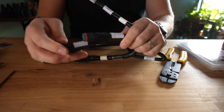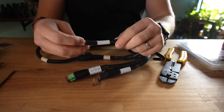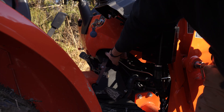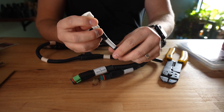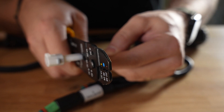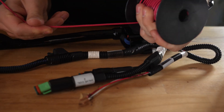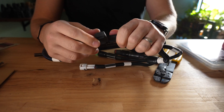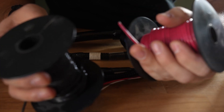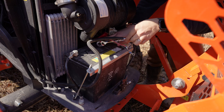With this wiring harness, you have two plugs for the valve coils and one 12-volt power supply. According to the instructions, this is supposed to hook up to a receiving plug on the tractor, but with the L2502 there is no plug to plug into. So what we have to do is cut these wires, strip them, and splice in some wires that will hardwire directly into the battery — it comes with an inline fuse. I have some 14-gauge wire left over from projects on my Jeep that I'm going to use to route it over to the battery.